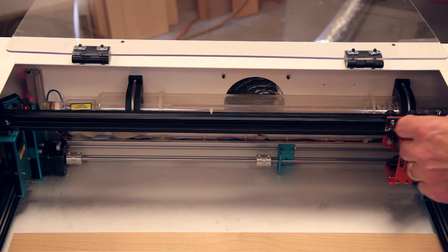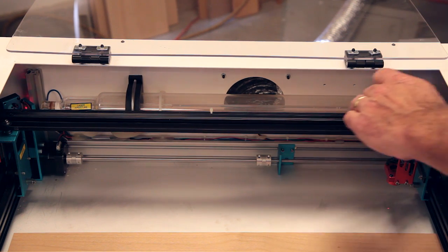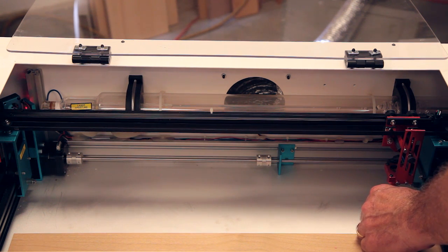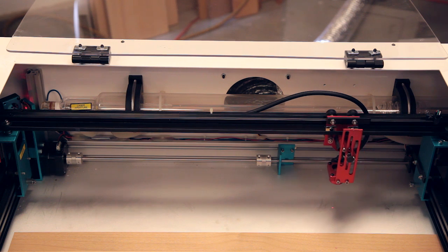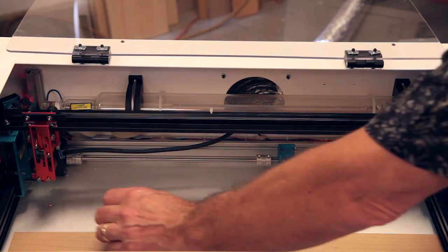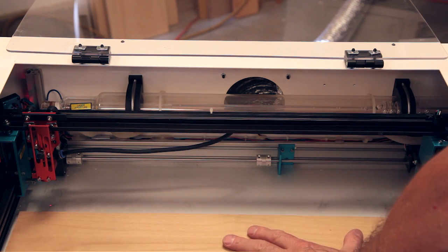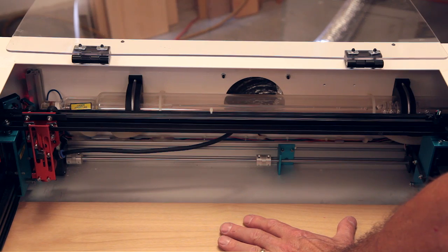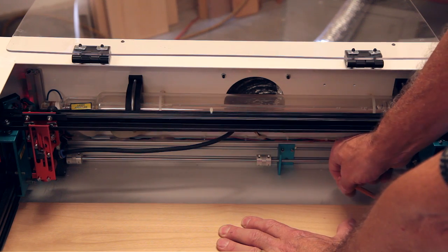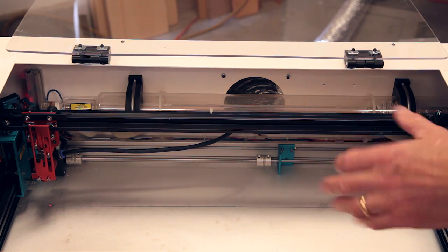Now you may not be able to see it in the video, but there's a laser pointer pointing right now, right there, and this gantry is all the way to the back. This is the X axis. I'm going to create a line by just marking this dot — a tick mark. I'm going to jog the gantry all the way over to the other side and do the same, make another mark, and now I'll use this straight edge to connect those dots. There we have it. That's how to create a registration line for your workpiece.